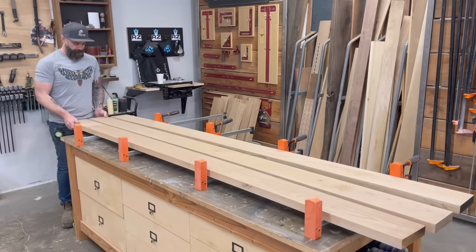After waiting for the glue to dry on our bases, I took everything out of clamps. I wanted to add a few little brace pieces in between those long aprons so they wouldn't be bouncing all over the place. I kept it simple — I milled up some three-quarter-inch white oak and used pocket screws to hold the braces up underneath the table. The last thing I needed to do to the base was create a system for attaching the tabletop. So I grabbed my domino joiner with the five-millimeter bit and drilled out a few mortises to use Z-fasteners to attach the tabletop to the base — my preferred method because it allows for seasonal wood movement.